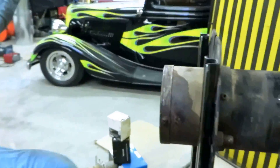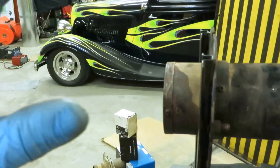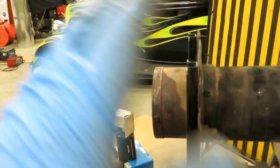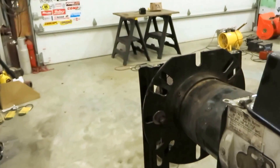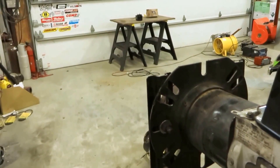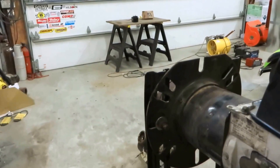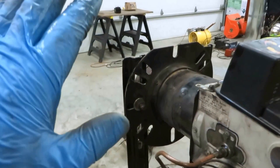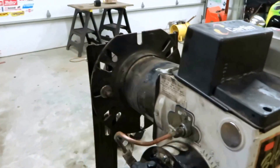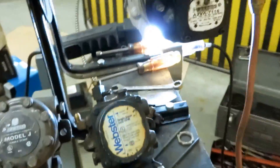Now obviously this is not hooked up to a boiler or a furnace. If your boiler or furnace is full of soot and it's blocked, nothing is going to work right no matter what you do with the burner. So there's more to this than just working on the burner — you're going to take the whole system into consideration. If the boiler or furnace is blocked with soot, you have to go in there and physically remove that soot, clean it out, or this system will not breathe. On this series I'm just going over the operation step by step of the burner.